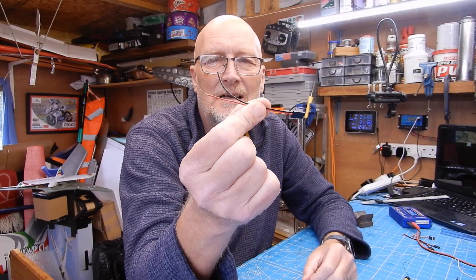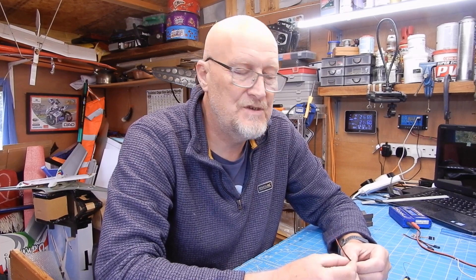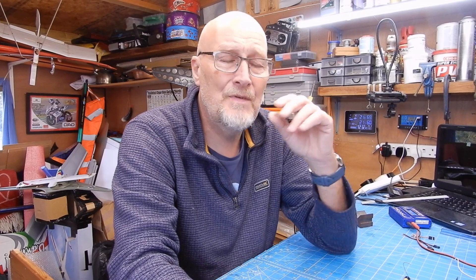I'm going to do some experiments — I think I'll see if I can get some more of these off eBay. I have a servo lead here which is thick gauge wire, so I'm now going to solder this up just as a one cell and try it either in the micro dammit or the dune freak. It's showing the voltage. I've got no idea how long it's going to last but I've got a voltage checker. I'm going to wire this up and see how we get on. I'm also going to look on eBay because I have the new BEC from Angel Wing Designs, and I'm thinking two of these soldered together would make 7.4 volts — they would fit right in the micro dammit. You could fly it for months on that.